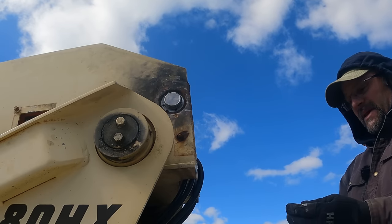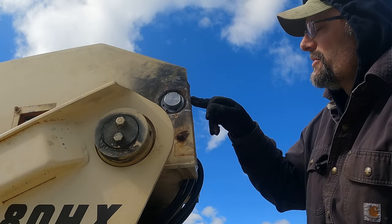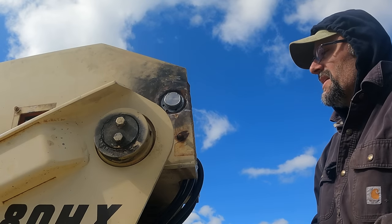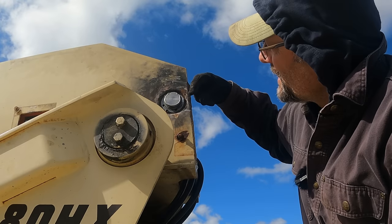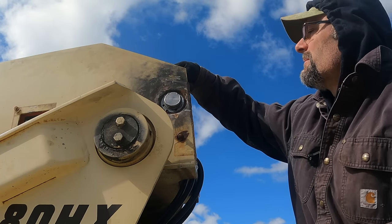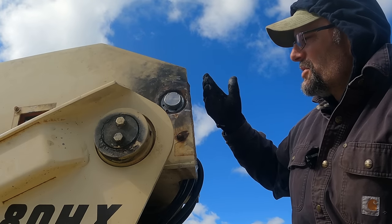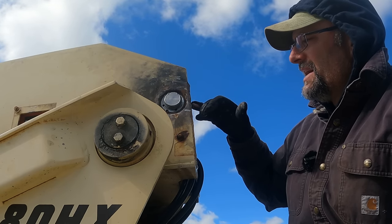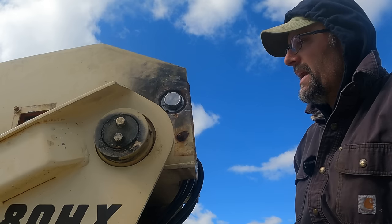Ah, the nemesis pin. And I'm sure some people are wondering, why don't you drill in some grease zerks right there? Well, I just don't want to modify this machine. It would probably be fine, yes, but I only have like 1/2 inch right there. And I could come in from the top too, I guess. But then I'm going through the eccentric bushing. I'm introducing a lot of potential weaknesses to this system that I don't want. I'd rather just not have to worry about that.